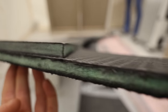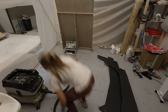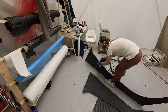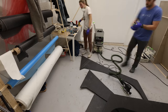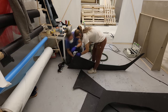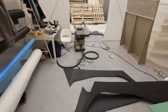The goal is to sand only the super hard carbon down to — but not including — the super soft foam. Our first attempt was with a rectangular vibrating palm sander. We didn't want to use a random orbital spinning sander for the potential that it could catch the carbon and rip it off the foam, delaminating the entire thing. The reality is this rectangle sander is just woefully underwhelming — nothing against Festool, it's great — but it's really just the wrong tool for the job.